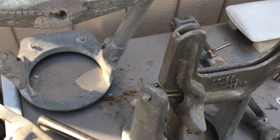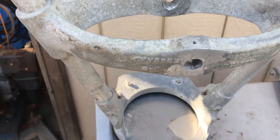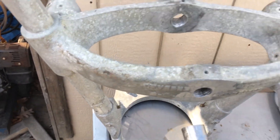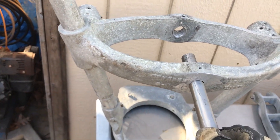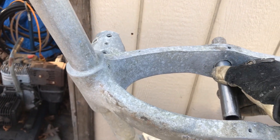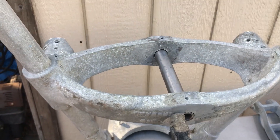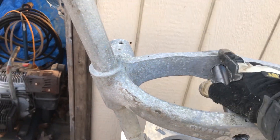This is the shaft that goes in there. On the upper part I had to do the same. I did have some issues — these grub screws stripped, so I need to drill those out. I was able to force it out knowing that I would kind of bend it, thinking I might have to just replace it anyway. I did hammer it out and that took several hours. Then I basically just filed down or sanded down the end that had expanded, and that worked out okay. The hole in here had to be cleaned out — corrosion on both sides.